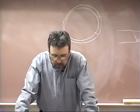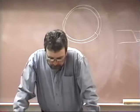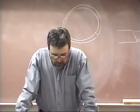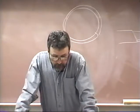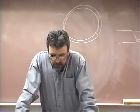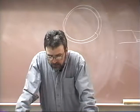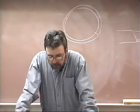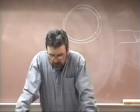At the end of each weave, the electrode should pause when it is centered over the edge of the previous layer, which will provide the correct bead width as well as fuse the bead with the edge of the joint without undercutting. As shown in figure 8-29, and this is the portion I'd like you to highlight, from the 12 o'clock to the 5 o'clock positions, a slant weave is used. For overhead welding, from the 5 to 6 o'clock position, a semicircular weave is used.